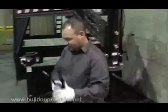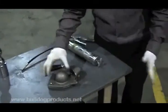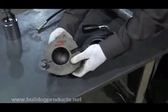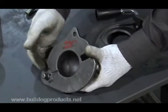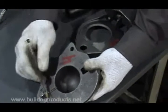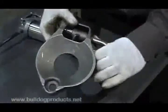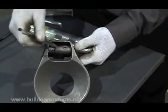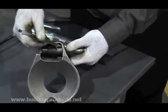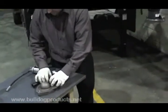The way all of this works is that we have grease tracks built right into our castings. Here's a set we've got disassembled so we can show you exactly what we're talking about. The grease zerk on top goes into a hole and comes out right underside the pivot pin. There are grease tracks underneath, allowing the grease to flow around the pivot pad as well as a track going into the ball pocket. Likewise, on the locking plate — when we flip it upside down and rotate the handle — inside the casting is another grease track going from side to side, allowing the grease to come out on each side so the locking plates operate freely and effectively.